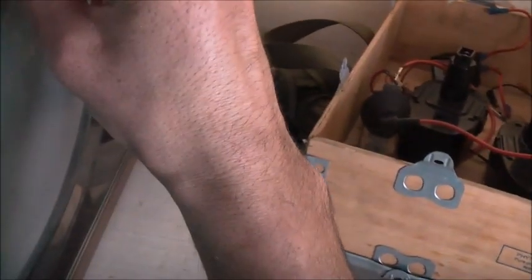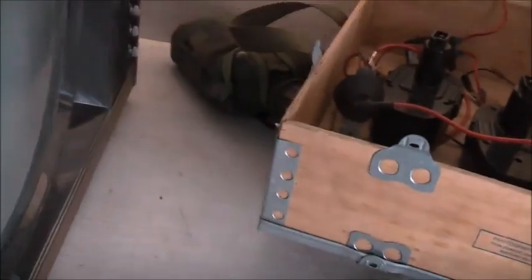It did deflect, the vertical did shrink a little bit, play up, but the way it was playing up is a symptom of a dirty pot. So hopefully it's a dirty potentiometer. And of course, if these are seized, in this case this one is, don't force them and try to turn them, it just breaks them. You're going to have to carefully strip that UHF tuning capacitor down and carefully lubricate it. Because this thing is pristine, I'm going to keep it in pristine condition.